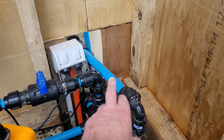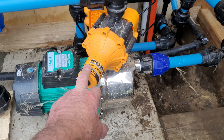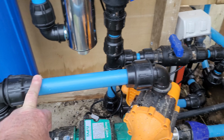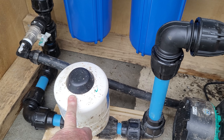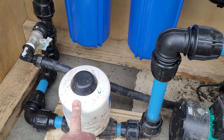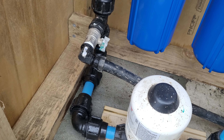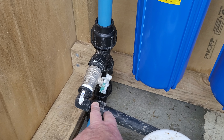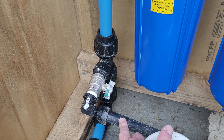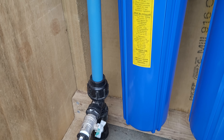The system is set up and complete. The inlet comes in from the tank, goes down through the pump - this is the pressure sensor that turns the pump on and off. It then goes along to this little pressure reservoir which has a bellows on it, so as the pressure builds up the bellows compress. Basically you can turn a tap on a little bit and water can come out without the pump coming on. Then we go across and up - this tap goes off to the farm, off to the troughs for the animals, so that's not going through the filter. It will also go to the pool, so we don't want to filter all the water going to the pool either.